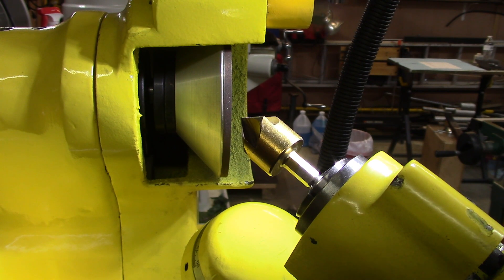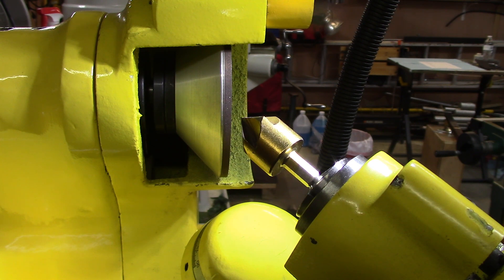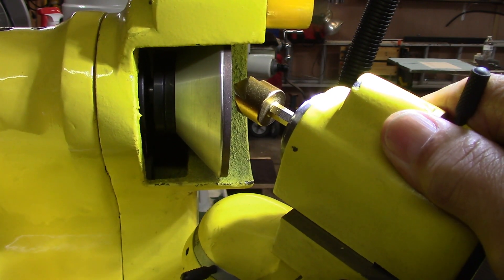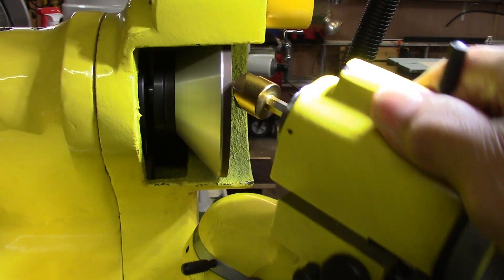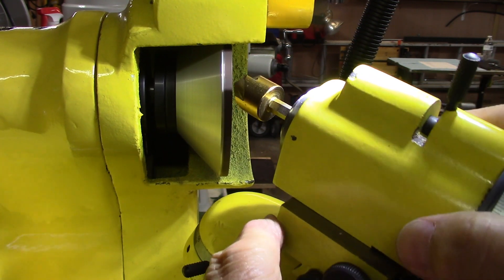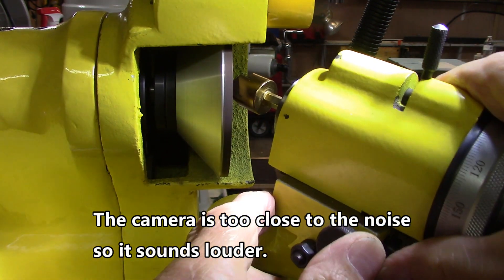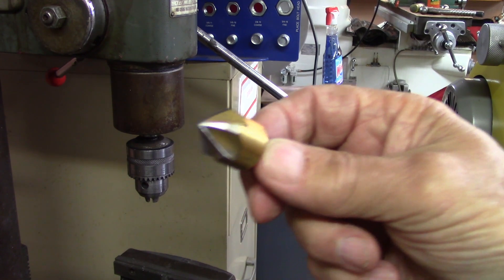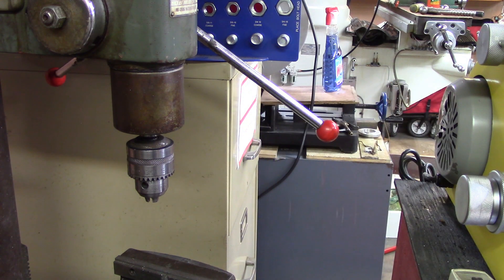In the video I made last week with these little cutters, I got frustrated when I couldn't sharpen the big flat edges of the countersinks, and I forgot all about going to clean up all of the flutes on the stone. Anyway, this is where I meant to be last week. Turning across to each flute, moving around to the next one — now they're all the same uniform height, so I think it'll cut even better.